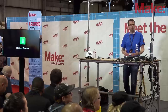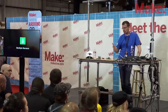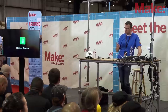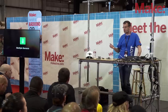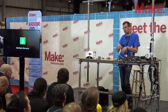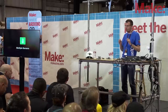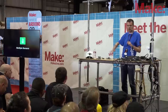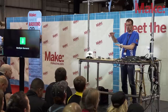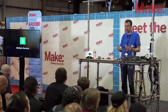We structured what we want to have in the platform. We wanted multiple sensors: a humidity sensor, a moisture sensor, a barometer, and of course an accelerometer because we want to track activity. You might ask why a wearable carries a humidity sensor — when you try it out, you see that when you start sweating, the humidity sensor close to your skin detects the moisture around it. The barometer very precisely detects altitude indoors — when I raise my arm, it detects the arm is up or down with a precision of 15 centimeters. So you can detect going up or down stairs, what floor you're on.